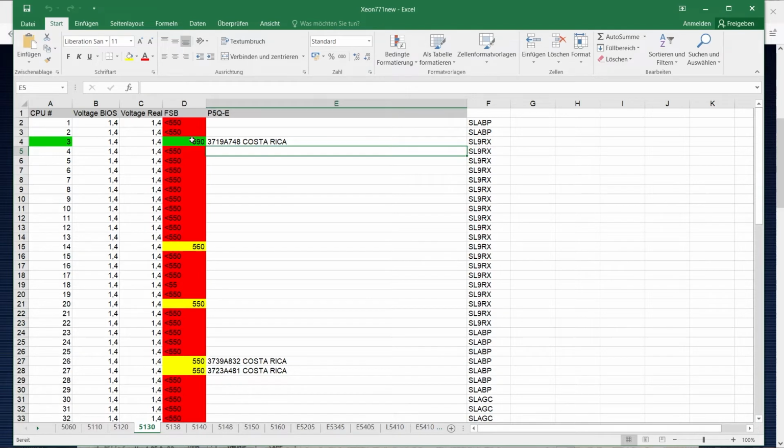Now, as you can see here, this is 590. Now, when I say 600, I mean 600 with tweaked VPLL. These chips scale with VPLL on basically any cooling usually. Strangely, some of them didn't like really high PLL for me on P35 on cascade lately, but this chip does just about 600 with, I think, 1.8 or 1.9 volts PLL on air. So all my binning data is with 1.5, so stock.